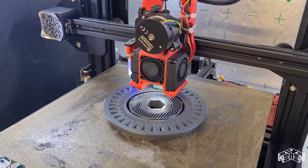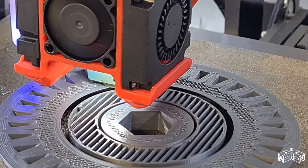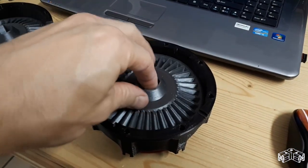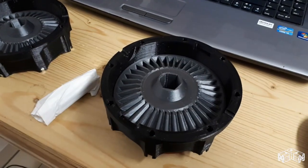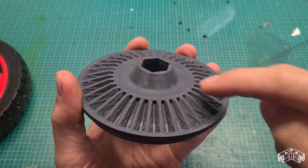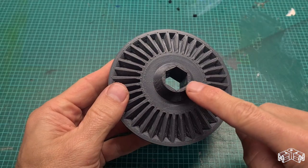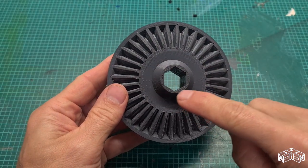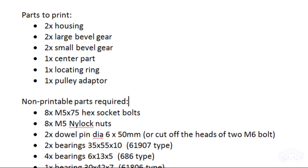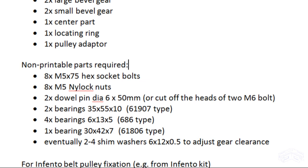For the material of this diff, I went for PETG to avoid melting it on a hot summer day. The crown gears are as large as possible so the teeth see the smallest possible tangential force. The teeth are connected at their inner and outer sides, which reliably prevents them from shearing off. In the center is the common hexagon profile for the Infento 19mm hexagon axles. In some places I use standard bearings, bolts, nuts, and straight pins, so in principle anyone is able to replicate this diff.